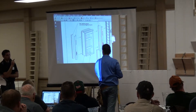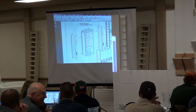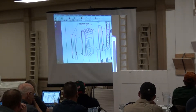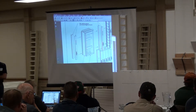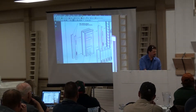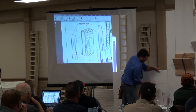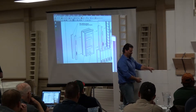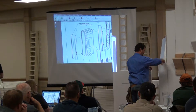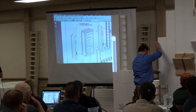As long as we keep concrete from being in contact with it, no problem using white lumber. Jerry measured up to where his window should be and put a line with a level so it's nice and flat, because you don't know if the footing is perfect. A level mark ensures the window goes in plumb, then he hand-cut with a handsaw keeping it nice and straight.